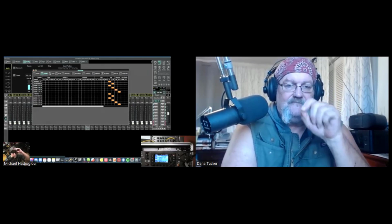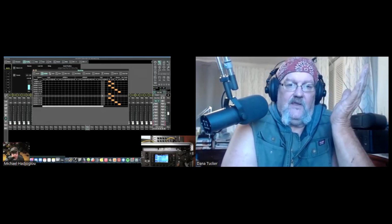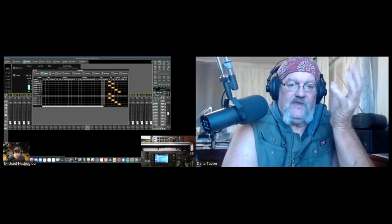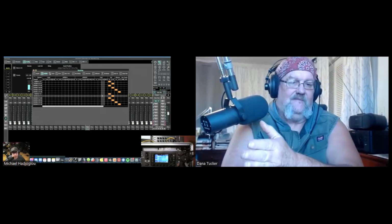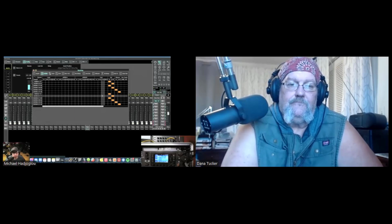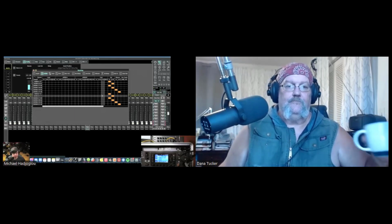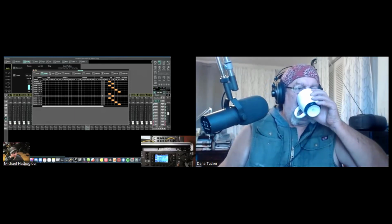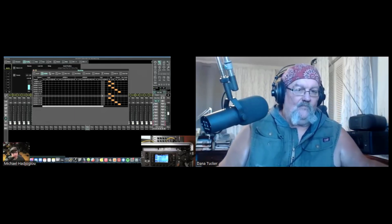That's correct. Like I said, mix bus 1 through 8, when the rack is set as internal, it is the master. The first 8 XLR outputs on that rack are going to be mix bus 1 through 8. Yes, by default, if you have a factory fresh console with standard routing and you have an SD8 plugged in and the switch is set to 1 to 8, the physical XLR outputs on the SD8 will match the physical XLR outputs on the X32 rack.